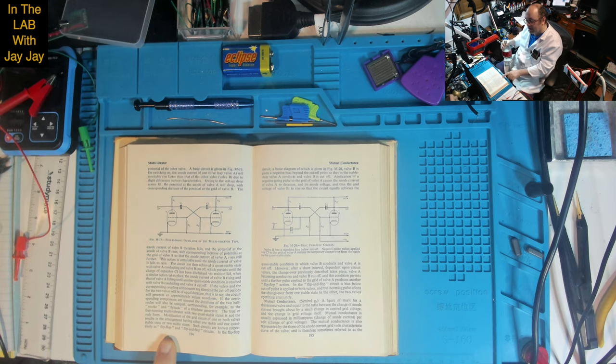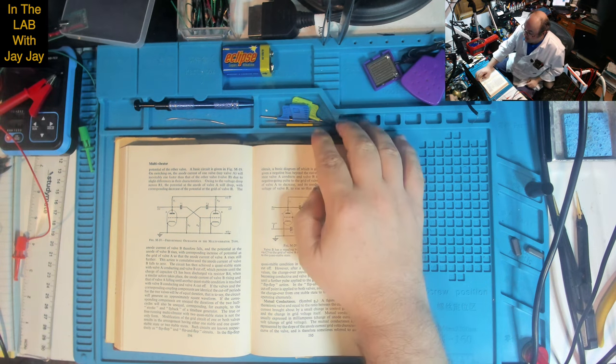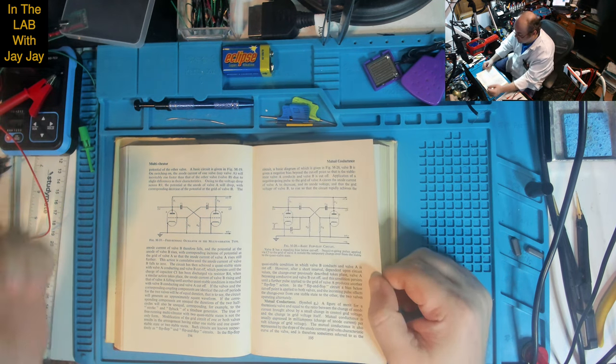They have a thing called flip flop, and they have another thing called flip and flop. Huh. I'm glad they decided that was a bad idea. Anyway, these days we have astable multivibrators, we have monostable multivibrators, which are also called one-shot multivibrators, and we have bistable multivibrators, which are flip flops.